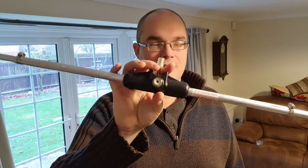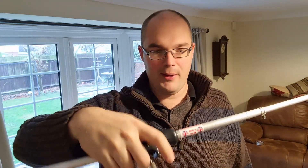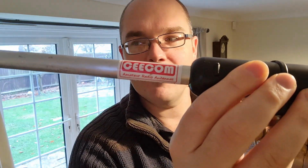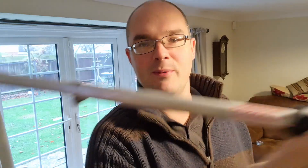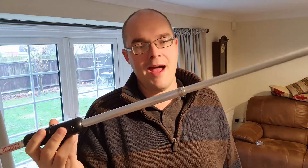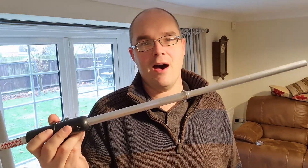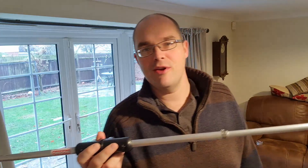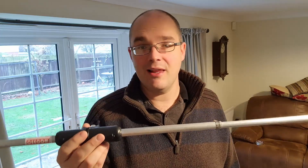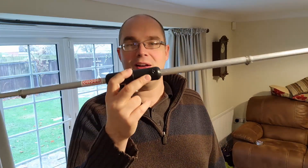I've got three different elements to this. Firstly I've got a dipole — this is by a company called Seacom, I picked up on eBay a little while ago. It's a great dipole; there's nothing particularly fancy about it, but it has got a telescopic element which means you can set it and tune it to different bands. I've set this to around resonant on 145 so that it can reach both up into the FM range and down into the SSB range, and it has a relatively low SWR on both.